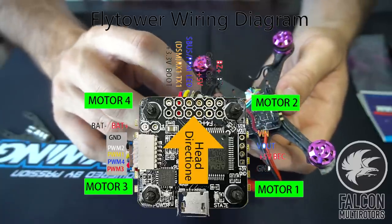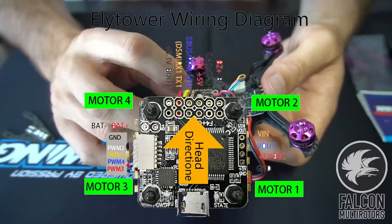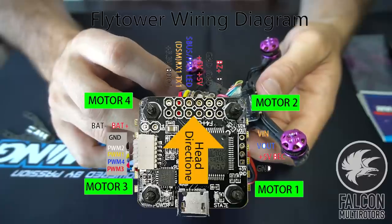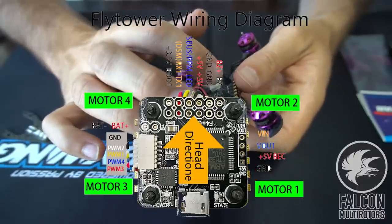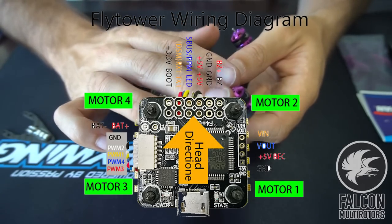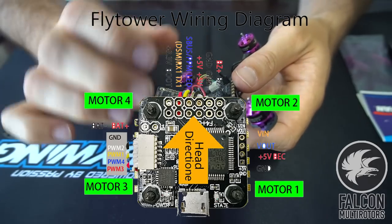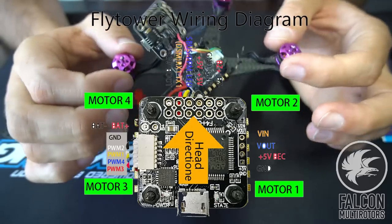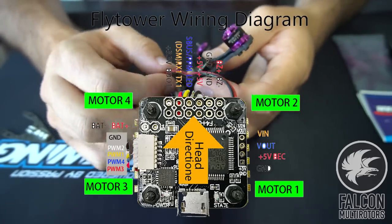It's also got space for a buzzer, but on these little micros and, you know, realistically any quad, you don't need a buzzer as long as you have the beacon delay set to like 1 or 2 minutes on your ESCs using BLHeli. After a minute, your motors will start beeping, and that'll be loud enough for you to hear where your quad is. So we can save some weight by removing the buzzer and just use the beacon delay on the ESCs to locate your lost mini quad.